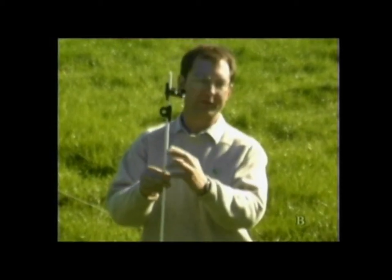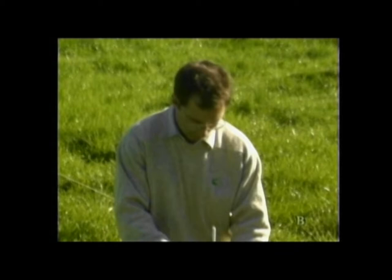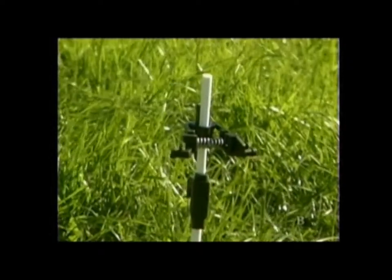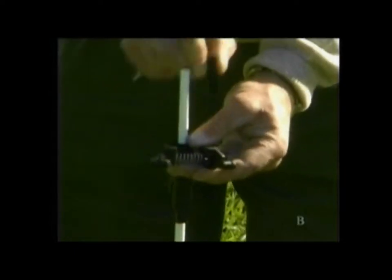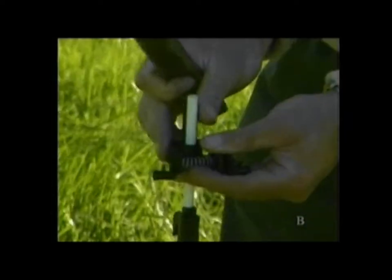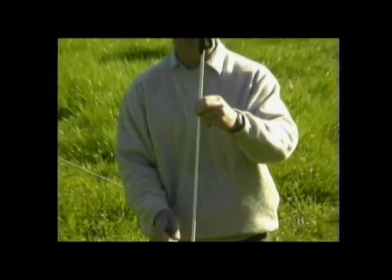This means that the clip on the stay post pushes up on the wedge. The release hook is mounted with a single wedge clip. To detach it, we just tap carefully on the release hook. To mount the release hook on the shaft, we pop the release hook on with all its features uppermost and drive the wedge in. In this case, the release hook is pointing in the same direction as the pedal.